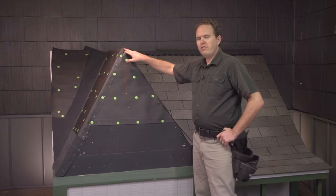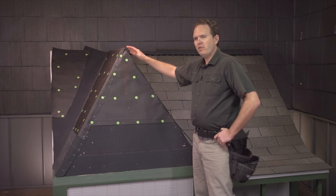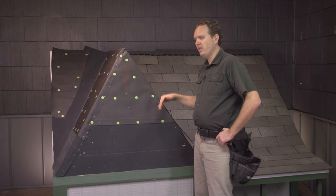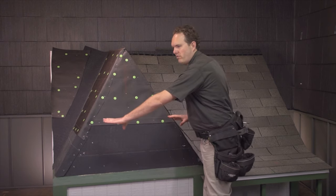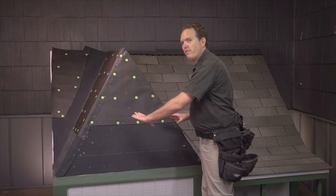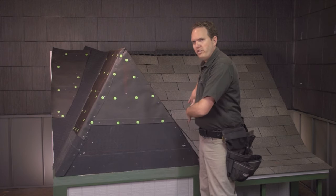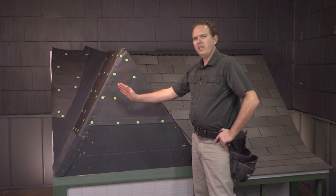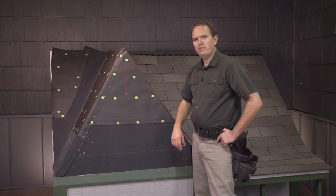Using the ridge peak as a starting reference is good. You want to start your bond line as close to the hip side as you can — you wouldn't want to start it further out — because when we're weaving the shingles in, it's a little more difficult bringing some shingles in from the left since they go under the other shingles. That's more of a pain than working the shingles out. So just start as close to the edge as you can, and then snap that line and get going with the starter shingle.